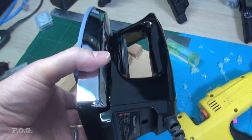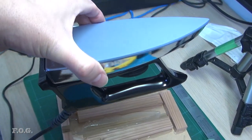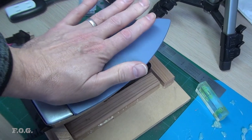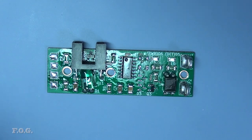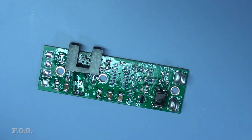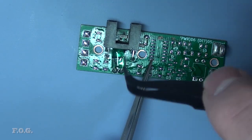high as 60%. I also bought this cheap $25 Panasonic iron, and I made a mounting base for it out of scrap wood to hold it in place. I'm pretty sure this is going to be a much better solution for heating the PCBs, but the heat control is pretty rough with the simple thermostat, so I'm actually thinking to add a computerized thermostat to this. You can see me using this setup for the first time to salvage all of the components from the old PCB, and you can see it works pretty well too.